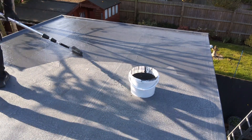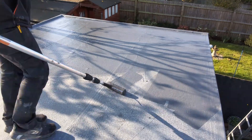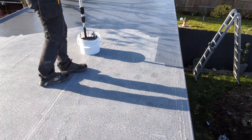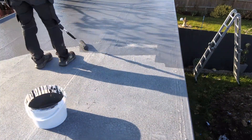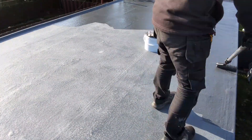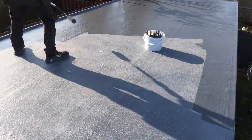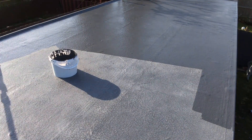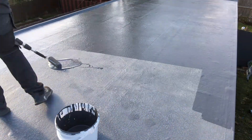I painted the whole main deck first, and then on the trim I came back after that was dry and used a brush and smaller roller. Be sure not to apply this too thinly — you're just pushing the resin around, not putting any pressure down. You want a nice thick coat; that's going to ensure that real aesthetic smooth look. Ensure you don't hang about when doing this, because remember this resin cures really fast. Just get it on the deck and roll it around.